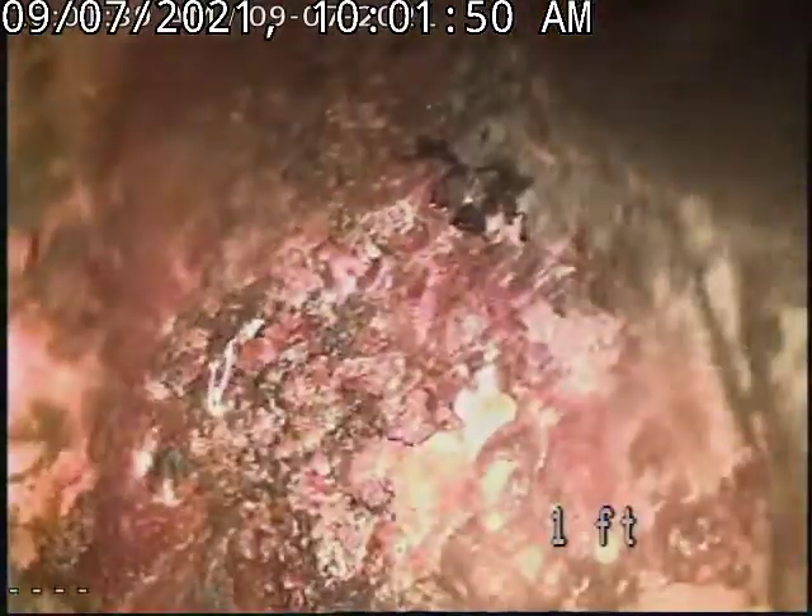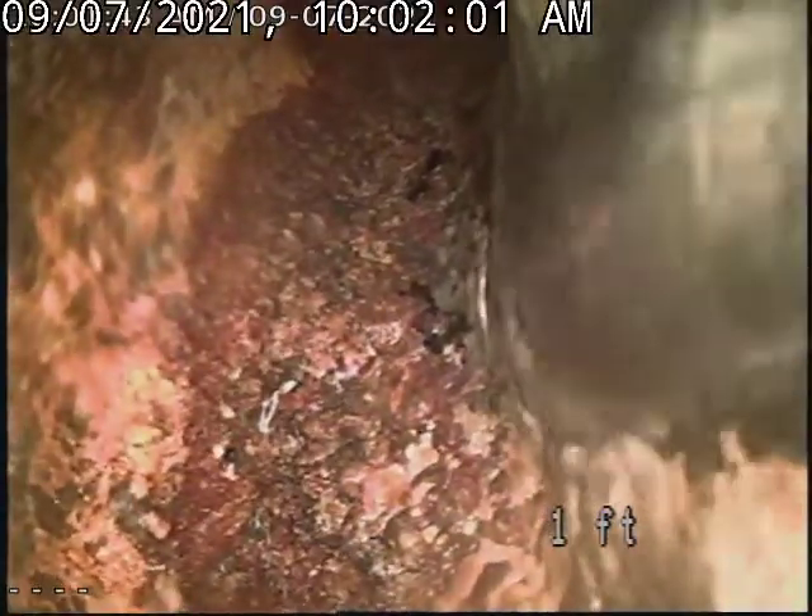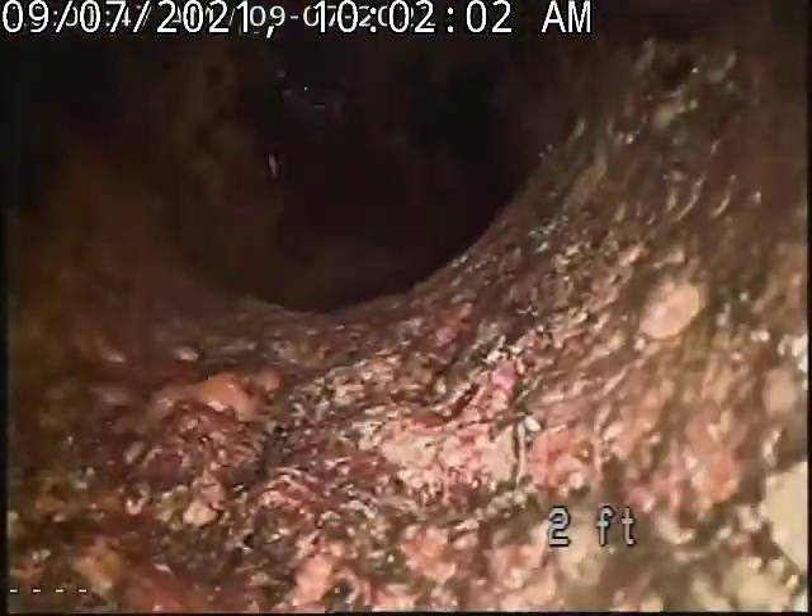She's 90-something years old, so I'm going to leave this decision up. Right here you can see the sewage leaving the building, and we're going to be tying on before this because the cleanout cap is so close to the wall — if we didn't, we'd have to dig outside. We're definitely a foot in under the footer, then it goes to cast iron and drops down into the storm or sewer.